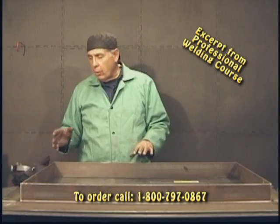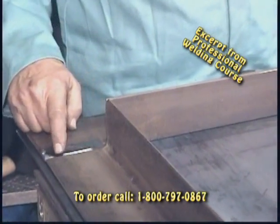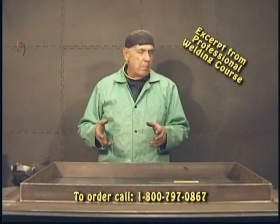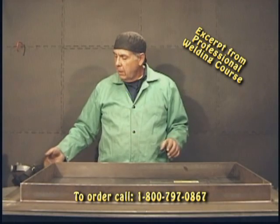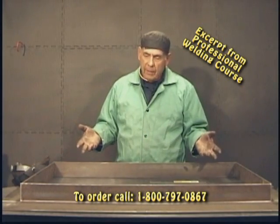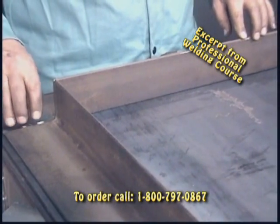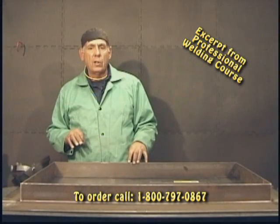Let me show you on the angle what I've done here. First thing I did was I took this corner of the angle that would have extended out and down — I took it off. I could have left it, but when you have a welding bench, you want to be able to get clamps all the way around it. This would have just been an impediment. I beveled a small bevel here just so that when I go put my weld in to tack this plate down, I've got some place for it to go and a little more welding bite.